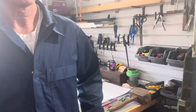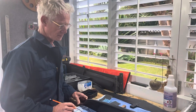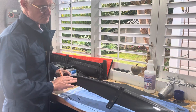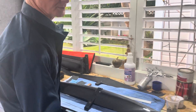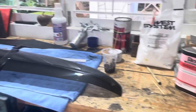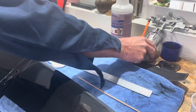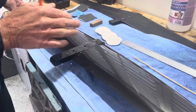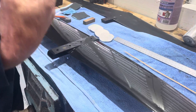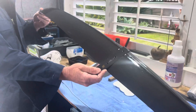Here's a foil that in previous videos I've shown you — I've worked very hard on it, we can have eight hours on this blade and eight hours on this blade, top and bottom. A lot of time has gone into this. This has now been sprayed with a urethane finish — it's a high performance clear two-pack epoxy urethane. I sprayed this in the conventional way using a compressor and a touch-up gun, and it looks beautiful. The flow coat has flowed out nicely and given me a nice surface from which to move to the next level, using a finer wet and dry sandpaper.